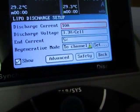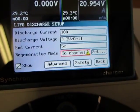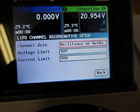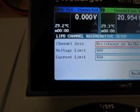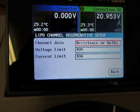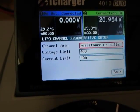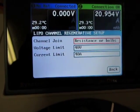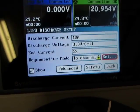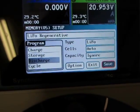We'll select 2 Channel — it's already selected. Since my resistors will handle up to 1600 watts, you can define voltage limit and current limit. For using light bulbs — say automobile tail light bulbs — those typically handle up to 2 or 3 amps. Run them in parallel, you can get up to 5, 6, or 7 amps, but they only take 14 volts. In that case, you would have to set different numbers.